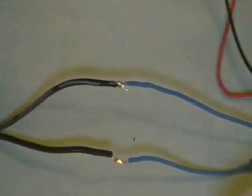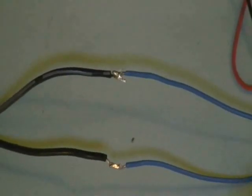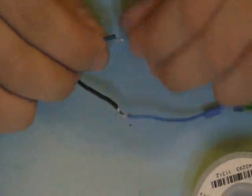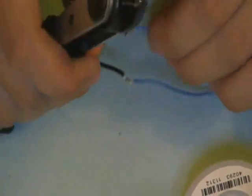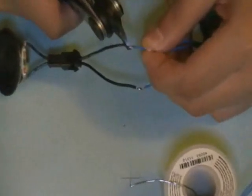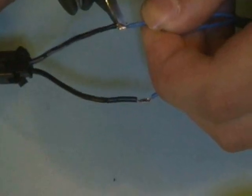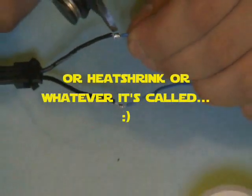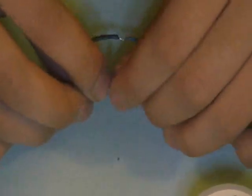These are some beginning examples — they're not the best solder joints in the world, not super clean, but it doesn't really matter. Brian may need to clip off a little bit of the excess wire in order to get the shrink tube to slide over. This is actually his first time using heat shrink, so he clips a little of the excess to make the wire flatter, and then he can slide the shrink tube over.